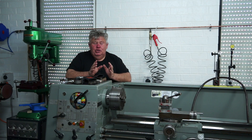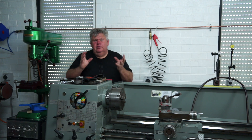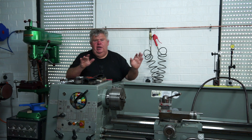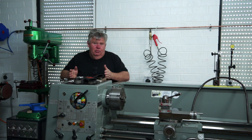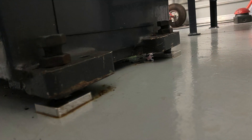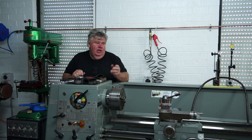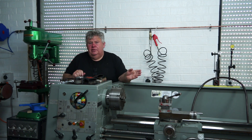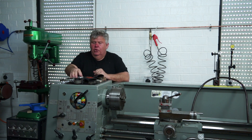It's quite amazing — you look at your workshop floor and think the concrete looks level, but looks can be deceiving. I can't believe how much fall my concrete has, which makes sense since this is a garage and water needs to flow out the front. The headstock side where I'm standing is roughly 20 millimetres off the ground — about three quarters of an inch — while the other corner is only about 3 millimetres.